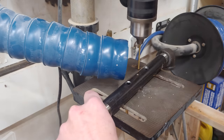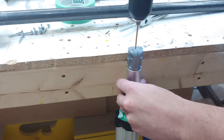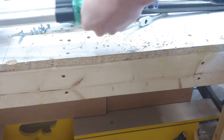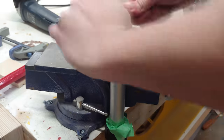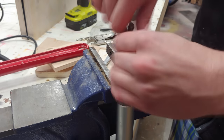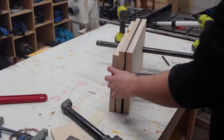Then over at the drill press I finally decided how I was going to mount this end of the vise to the linear actuator — simply drilling a through hole through the nipple and then a tapped hole into the end of the linear actuator. This is aluminum on the back of this linear actuator but it is the toughest thing I've ever had to tap. Maybe it was the wrong tap or the lack of cutting fluid, but it was crazy. I thought I was going to break it several times. After that I realized I had to take the vise apart again and chop down the thickness of the top board in order to have the front jaws sitting flush with the top of the table.